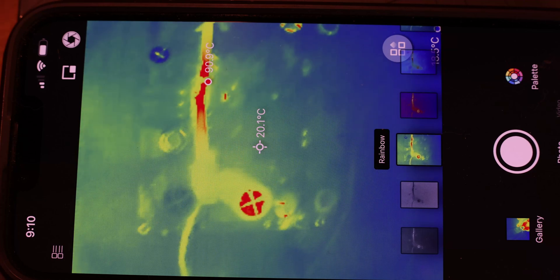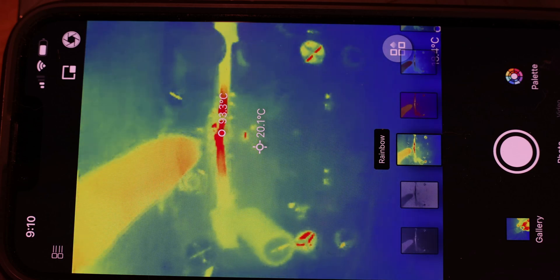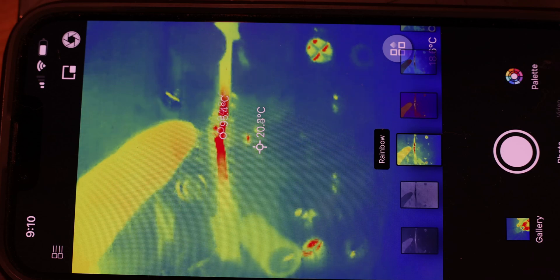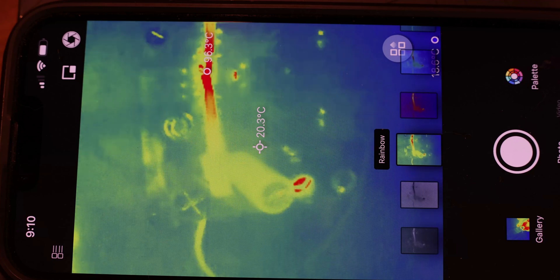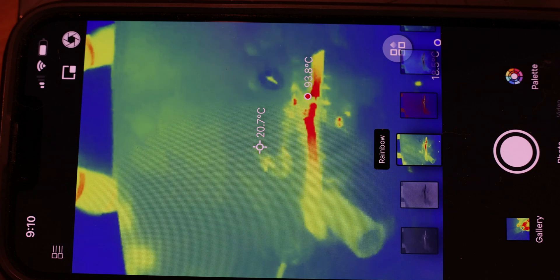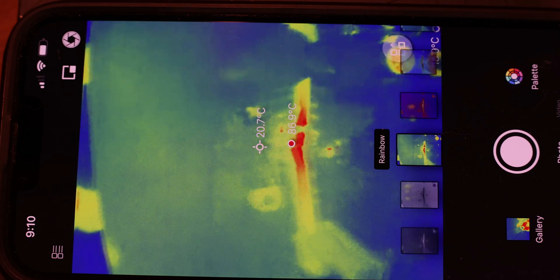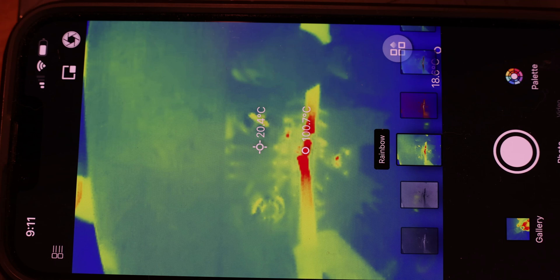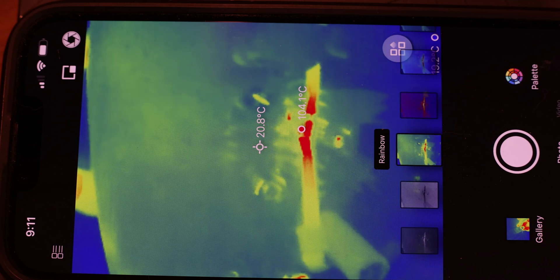Right away you can see that there's something hot in here. There's a resistor registering close to 100 degrees Celsius — about 98 right now. Moving it a bit more to center, about 92 to 93 degrees. I'll increase the voltage a little bit more. You're going to see the temperature rise — we passed the 103 degree mark, so it's getting really dangerously hot.